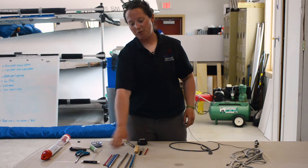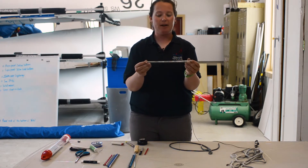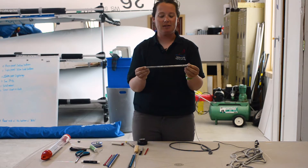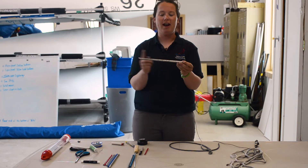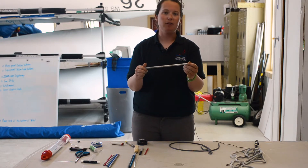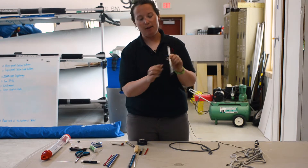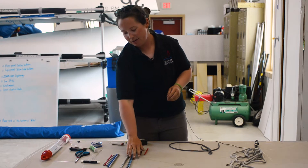It's also going to come with an assortment of fids. This is a tubular fid. When you are reading instructions and something refers to a fid length, this would be a full fid length. They also make wire fids, which are half of a fid length — those are for longer line. They're all labeled with the length of line that they're used for, so before you start splicing you're going to want to know what size line you're using.